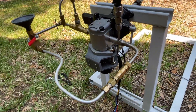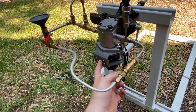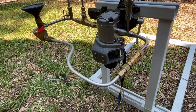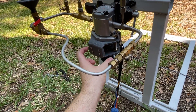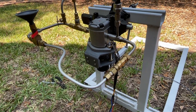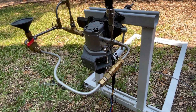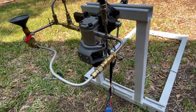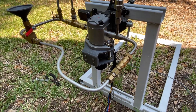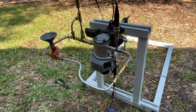Eventually, in terms of the pump hardware, these will be real sheet metal brackets. Right now it's just temporarily put together with plastic, which actually works fine. It's just not something that will be acceptable for the full engine, where it would melt pretty easily if there's a fire.